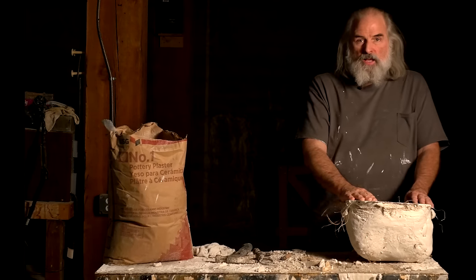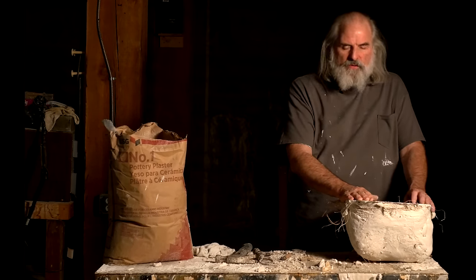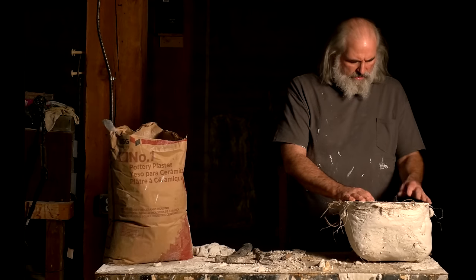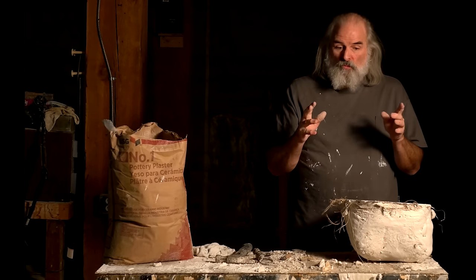Then here's a metal loop tool that works very well. You can actually hit the plaster as you're working with this thing. It won't hurt it. And then a much smaller tool for fine details, to get in there and hook at this side. We've got really little bits of clay. And so we're going to peel the clay out. Take your time and get it cleaned out well. If you have access to compressed air, you can just hit it with air and that'll help you get it out. But if not, just be patient, get it all out, and then you're ready to pour it up.